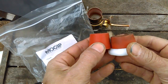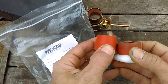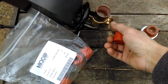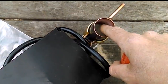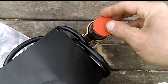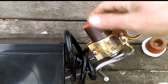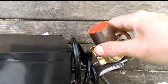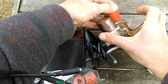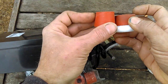If you take my finished cap and put it next to the original, you can see I trimmed off nearly a quarter inch — maybe three-eighths of an inch. The reason is that the copper tubing running back up into the cook pot needs at least a quarter inch on the inside, and I didn't want the cap to push all the way down and touch it. So I cut three-eighths of an inch off the bottom.